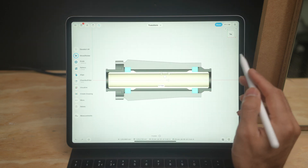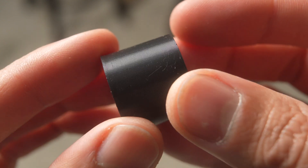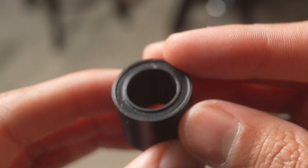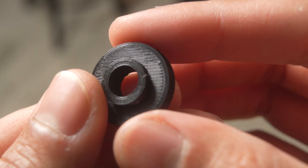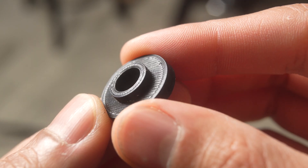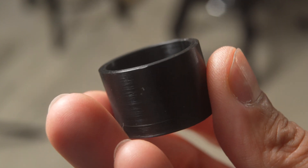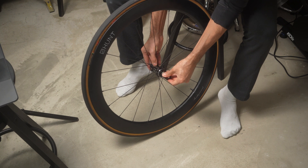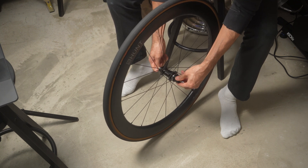I have a small amount of knowledge of CAD and a 3D printer, so I made myself out of PLA: a bearing drift to press the bearing in straight, a spacer to push the axle into the bearing, and a cup or extractor to catch the bearing on the other end. You don't need to do this if you've got a socket set lying around — a 17mm and 20mm will do you just fine. Oh, and a couple of washers.